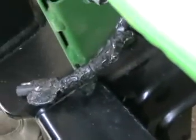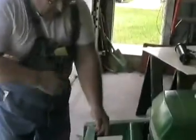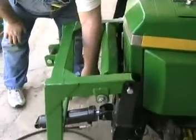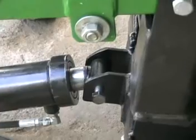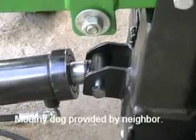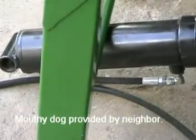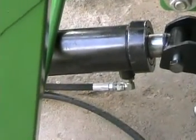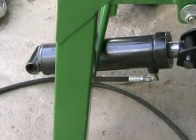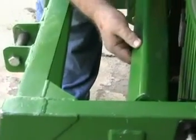And you just simply tighten it up just to make sure that everything stays on there when you're loading your bucket with whatever. We jumped ahead a little bit here, but on the lift cylinder you got the narrow end down on this sub base, and the grease fittings are pointing down. The reason is to keep it from possibly getting into the frame of your tractor. Also, when I first saw it, I thought that having these grease zerks sticking down towards the ground was going to be wrong, but it isn't, because the cylinder is going to come up and fasten up into here.